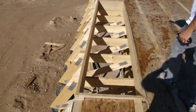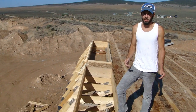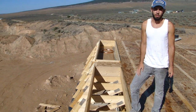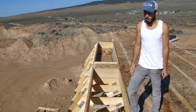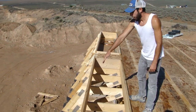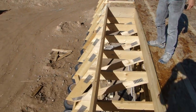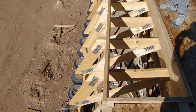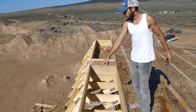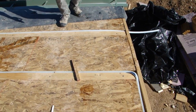Another thing that came up was the skylight vent box for the greenhouse and the battery systems box. My plan said they needed to be two feet wide, but that was too narrow. I checked with some crew guys and they'd made a change in the past six months to make them wider — now they're 31 inches wide. We also originally had them further up on the trusses, only about an inch from the crown, but once we got the poly iso insulation and roofing up, we realized we needed that extended front face. So we had to cut insulation out the back of these boxes, cut the decking out, move the boxes back, and put more triangular pieces in to extend that front face.